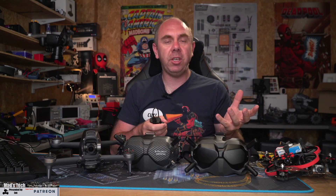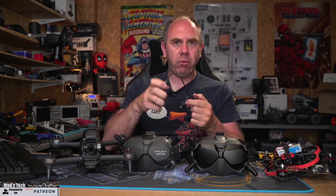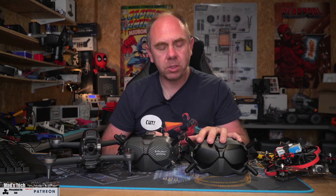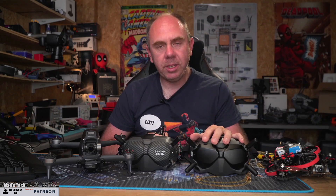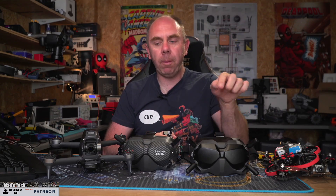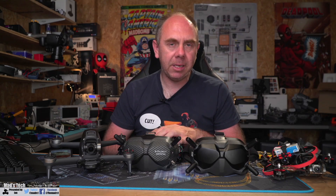As I've already said, DJI do have a new firmware coming which does resolve the issue, and I've been able to prove that for myself. What I'm going to do now is actually show you the goggles' low-power behavior when this happens. Whilst the DJI battery does appear to have a low-voltage cutoff, the goggles version 2 don't, and there is pretty horrible behavior when the battery level gets down to about 5.2 volts — the goggles begin to cycle, lose the image on the display, and reboot repeatedly. In the new firmware, in my bench tests, they no longer boot back into FPV drone mode and they boot back into the correct mode for use with the FPV air units. Also when I've done the reset test the goggles have been keeping the option there as well so you've still been able to get back into the correct mode.